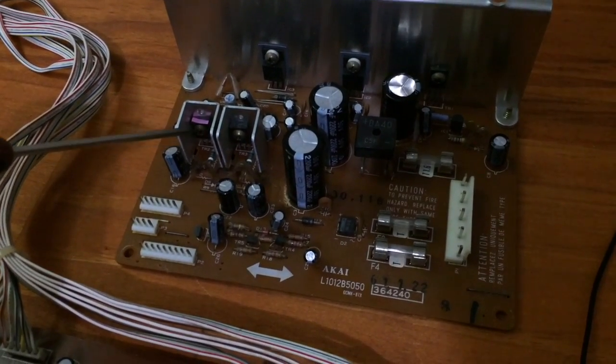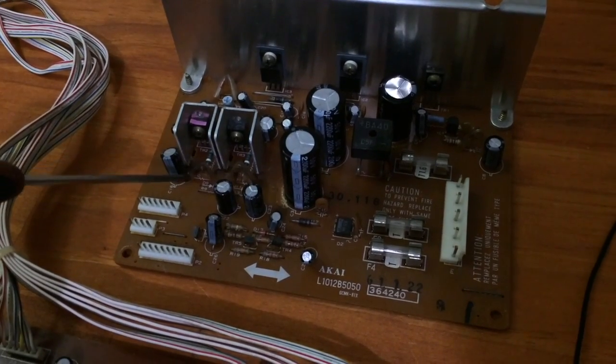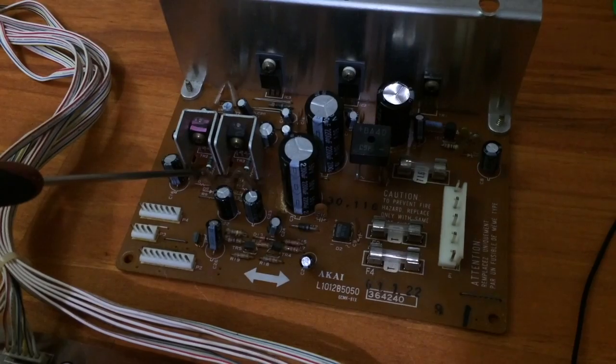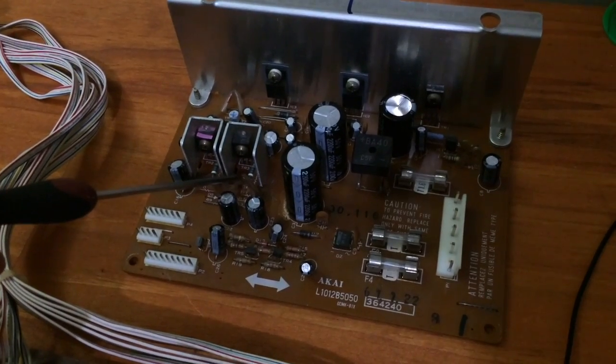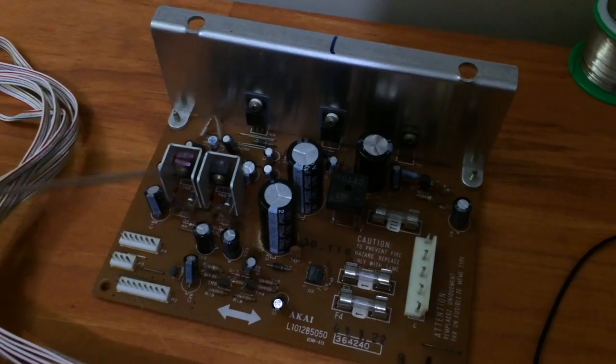And also, not only do they feed all the voice chips and all that kind of stuff, there's some Zener diodes in front of them, which the 5 volt supply is derived from, so they also drive all the logic and the CPUs and stuff like that. So this whole area is already getting quite hot.